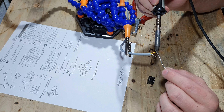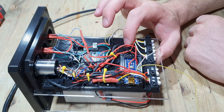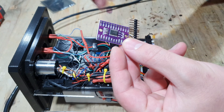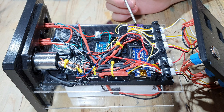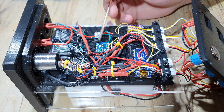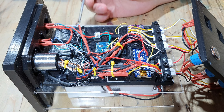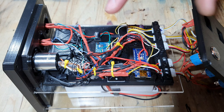While re-soldering the cable my soldering iron started acting weird — whenever I picked it up it displayed an error message and the temperature readings were all over the place. I'm pretty sure it's a loose contact in the cable. Ersa the manufacturer offered to fix it free of charge, but I wanted to finish this project so I kept going, wiggling it a few times to get it to heat up. Since the 24 volts fried not only my Arduino but also my multiplexer, I had to buy a new one and install it. It is finally done — everything is wired correctly. While replacing the damaged multiplexer I also replaced the analog-to-digital converter to make sure I won't get any false readings.